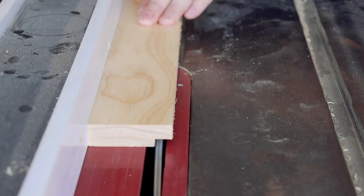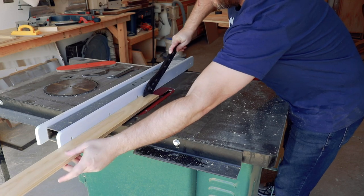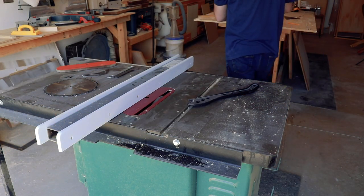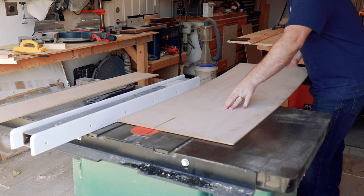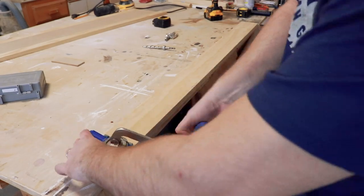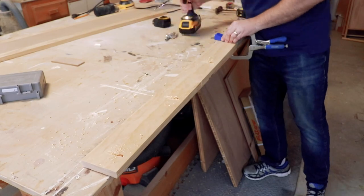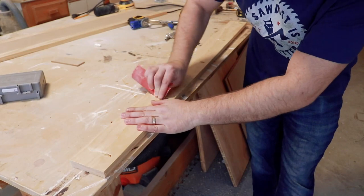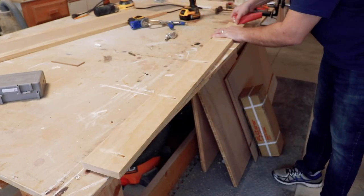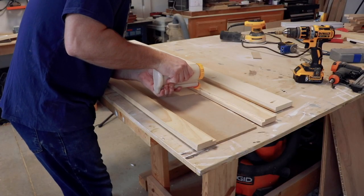The first thing I have to do is create the rabbets. This is what holds the MDF board in place and gives you that Shaker style look. There are a lot of repeatable steps to building this fireplace — sometimes I find that really enjoyable, other times I get kind of bored, but that's just how woodworking goes. It is nice, however, to see when your pieces start coming together and you start gluing things up. That's when it really becomes real.